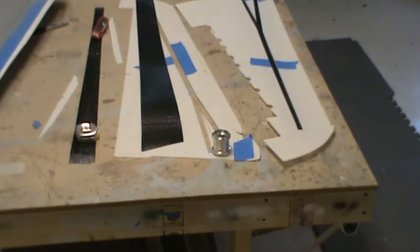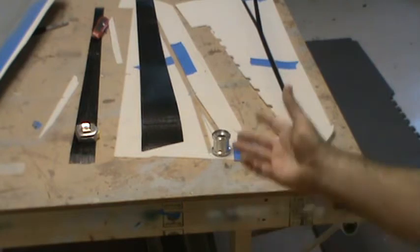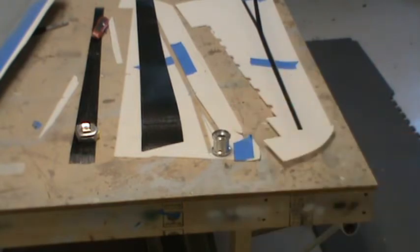Again, the F-14 fuselage produces a fairly significant amount of the lift for the airplane compared to the wings. I think it takes up something between 30 to 40% of the lift. So if you've got a 65-pound airplane, somebody do the math, what's that? About 20 pounds of lift roughly that the fuselage is producing. So that only gives you another 20 pounds of lift roughly per wing panel. So if you've got 300 pounds of force on one wing, that's about 10, 12, 13 G wing loading.